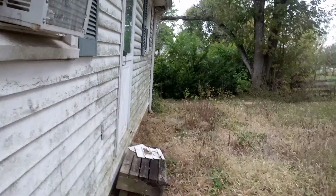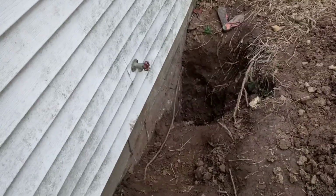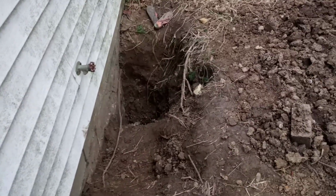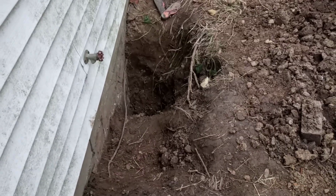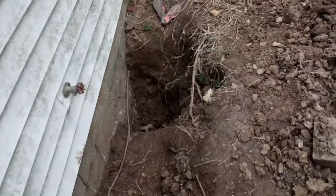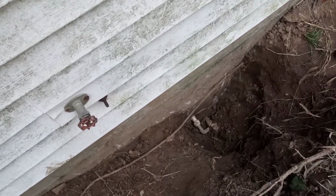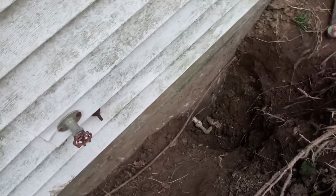He wanted to bring a backhoe in alongside the back of the house and dig this up. Had he done that, he'd have done more damage than the dollar part it took to fix it. I put an inferior part back in it because that's what was in it. It naturally needs a piece of cast iron, cast iron to cast iron. Instead, this is cast iron to plastic to cast iron. So there was a lot of work digging that up.